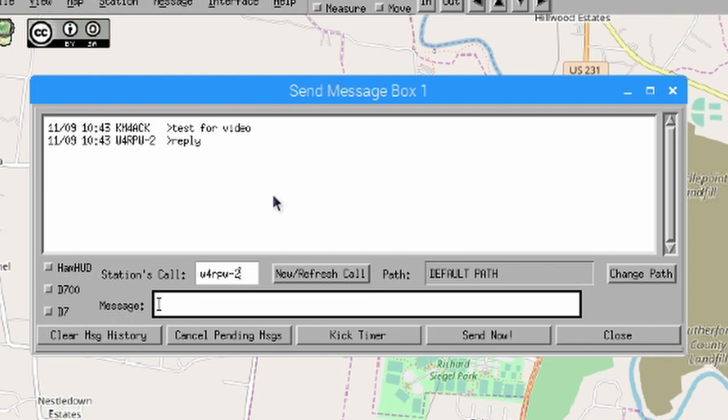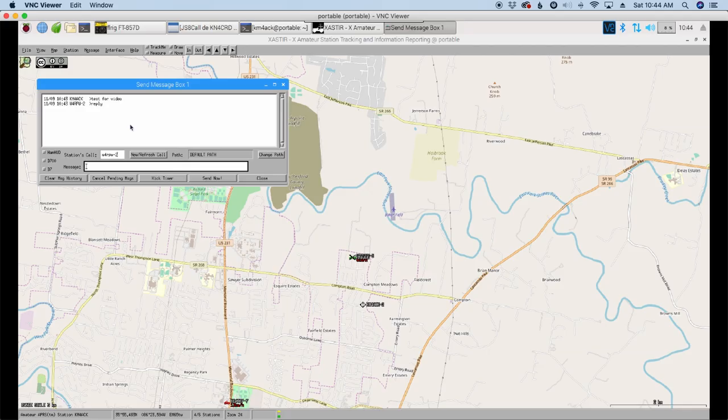So this could be used as sort of an instant messaging system inside a network with everybody tied to one APRS unit. Think about utilizing a system like this in an EOC — an emergency operations center. We set up one radio, one Raspberry Pi, one sound card, and one antenna to create the APRS system without any internet. It could receive everything over RF, and then by connecting multiple systems to it, we could display that information out to other systems. At the same time, we could establish a way for messages to be passed between different desks or different areas inside the EOC.